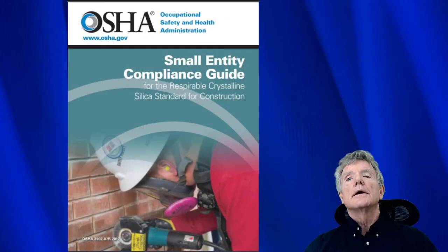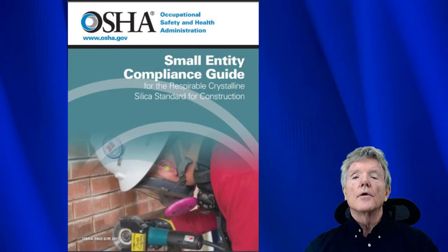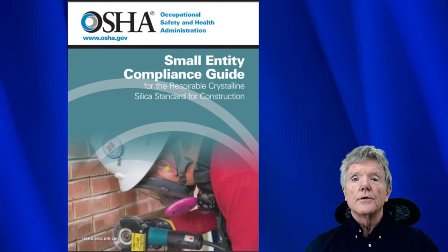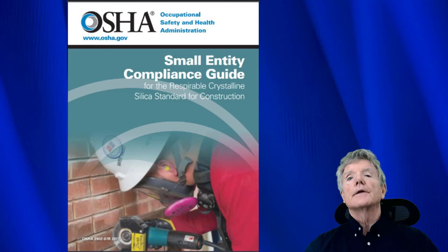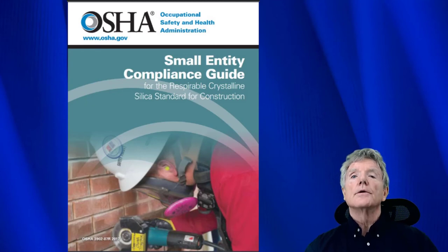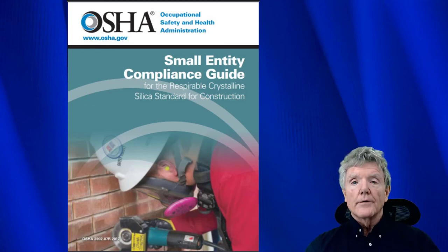As you can see here, using the method for blowing out tie-down holes, using the instructions in P1100 can be hazardous. In order to do this, you must use special P100 masks that are very well sealed, and it's not always something you can count on contractors to do, and it will expose them to very serious health hazards.